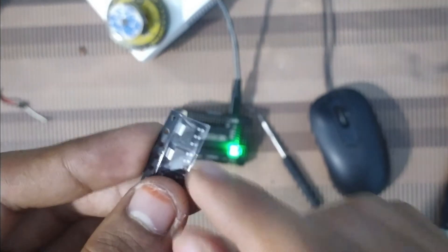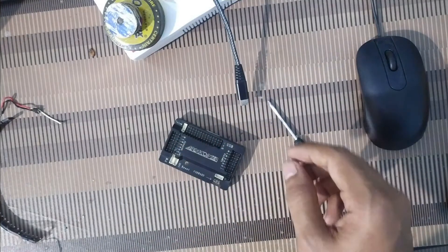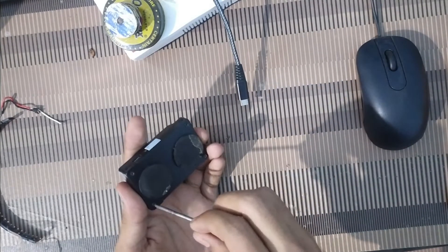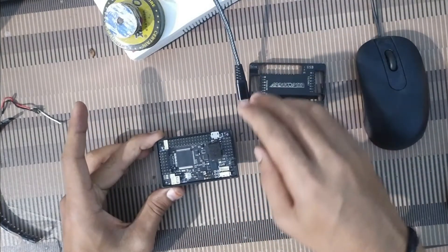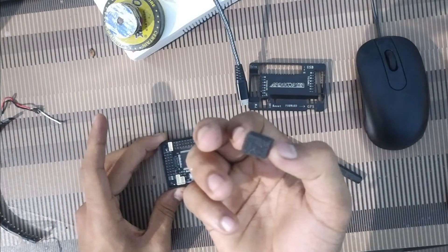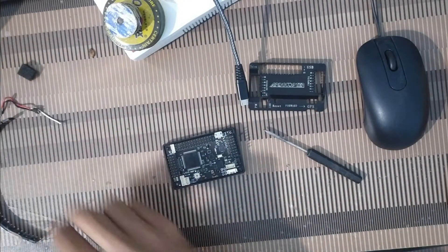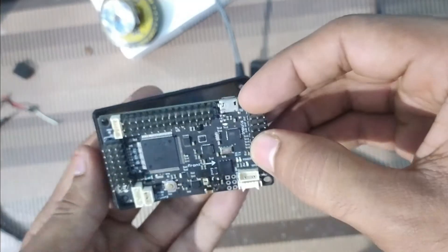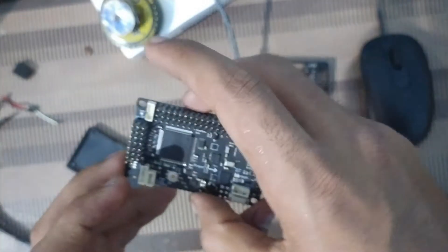I will provide a wiring diagram here. Let me disconnect the APM from the computer and open up the APM board. Be careful that you do not lose the foam/dust cover piece, as it protects the barometer inside the APM board. Here is the APM board — set it aside and now let's proceed.